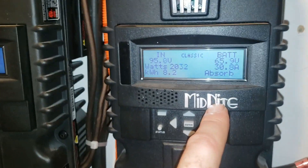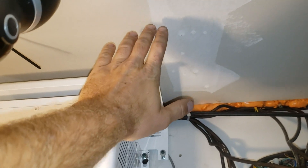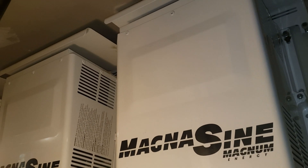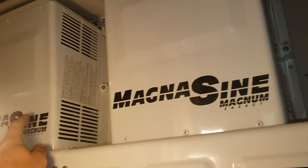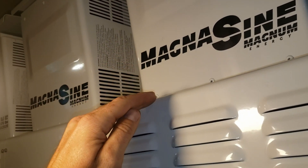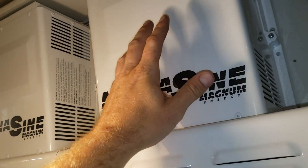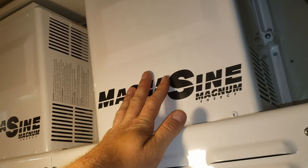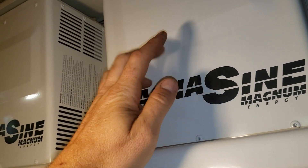We are fully charged. The new position of my Midnights — I put two little fans on the bottom just to help airflow and help everything stay cool, then I put this fan and this fan here because it gets all insulated and sealed up, so it gets quite hot — this just circulates airflow. This thing's humming along nicely. I actually think this inverter is better than this one, because this one at 66 volts the voltage would fluctuate and I'd get flickering lights. This one doesn't seem to be doing that. Making this one the master has fixed pretty much all my flickering issues.